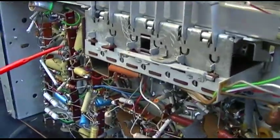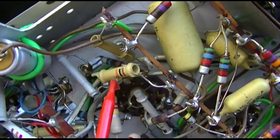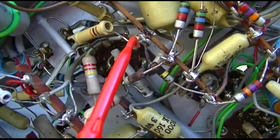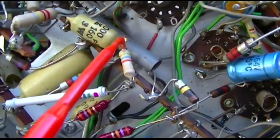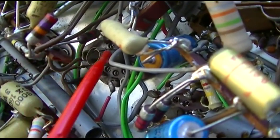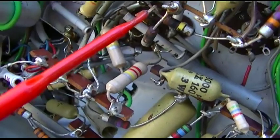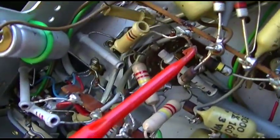I'm checking and I believe it's this capacitor right here — brown, black, orange. One side of it is connected to the plate of the 12AX7, and then it comes here through this 100k resistor, and from there it drops straight down to a 1k resistor to the grid. If we check on this side of it we're getting 15 to 18 volts, and if we check on the capacitor side of it it's a little bit higher. So I'm pretty sure this capacitor is leaking.